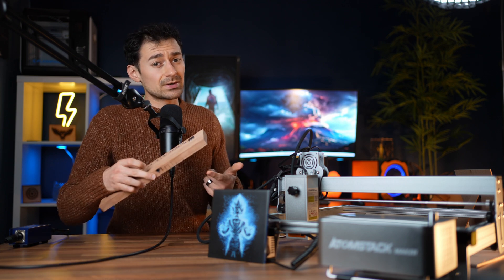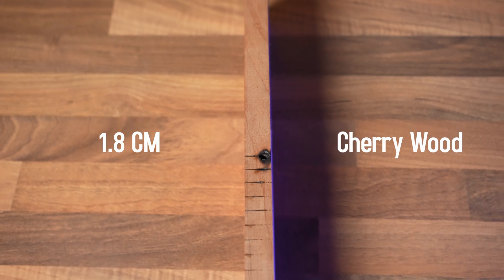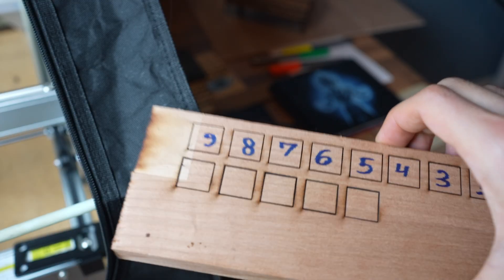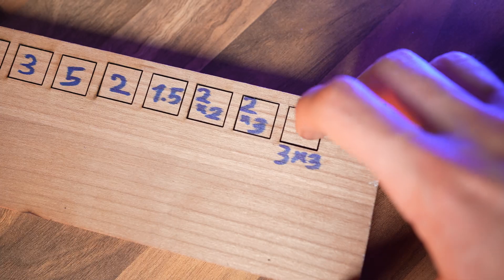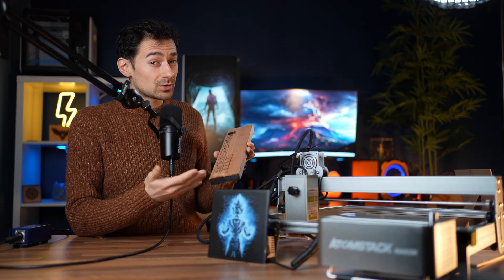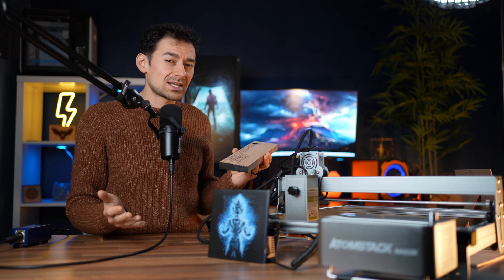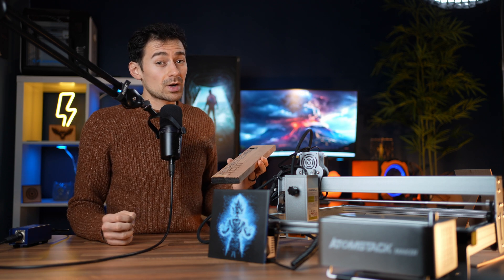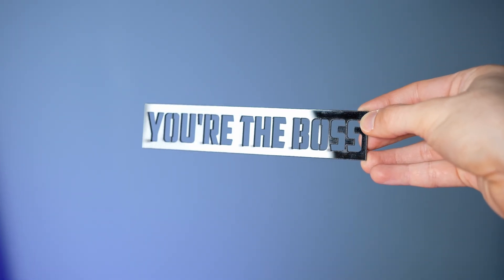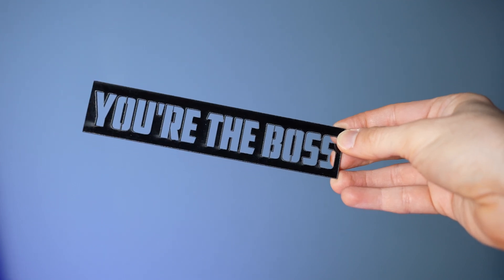Three millimeters isn't much, so I tested on thicker material — 1.8cm cherry wood — which was a little too hard for the machine to handle, though it got pretty close. AtomStack claims it can cut 2 centimeters, and cherry wood is quite dense, so it's understandable, but it is unfortunate it couldn't cut smoothly. It can cut 1.5 centimeters, which is not bad. I also cut acrylic with ease, getting a clean piece of text. Cutting accuracy is very high and cutting power is around average.